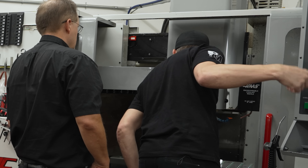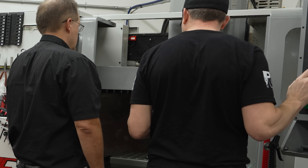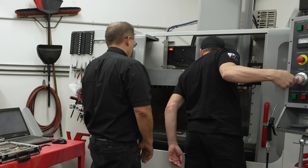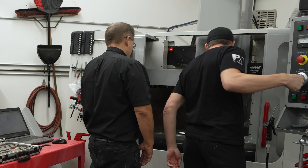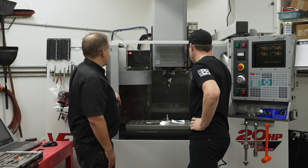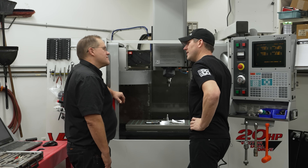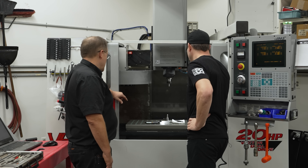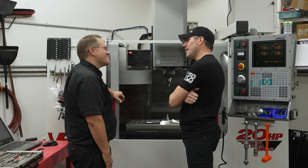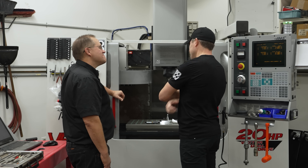Let's see if you guys can hear this — it's pretty loud in the Z. In the Y I don't hear it, but there are certain times. Run the X so you can compare it. Here's the X — smooth as silk, nice and smooth. So I think that's pretty much diagnosed. I think your screws are good — I've seen a lot of bad ball screws and these are probably still in good shape with a lot of life left in them. That's good to hear. If you put all new screws in here you're going to be spending — 30 grand. I just wanted you to tell me it was only the bearings, and I'm glad it's only the bearings.